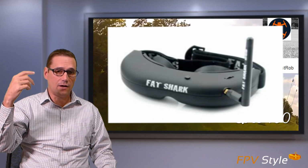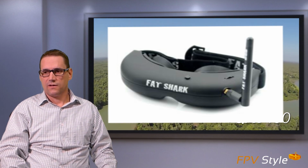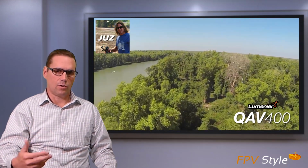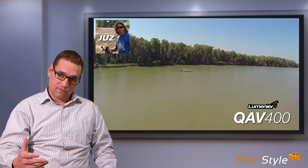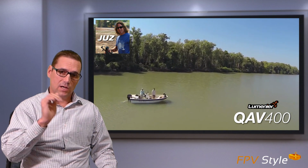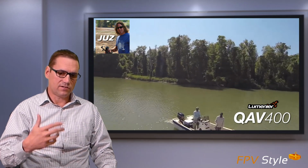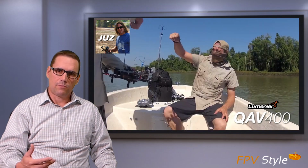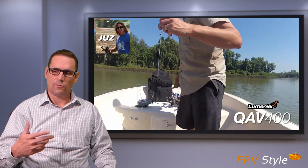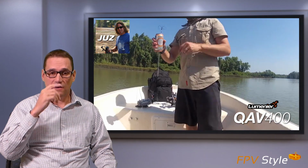But for the most part, what we like about 5.8 is it's easy and quick. Most of the time, you're going to buy FPV goggles, and you can buy FPV goggles with an embedded 5.8 gigahertz receiver, so it's a very simple, cost-effective, affordable, easy way to get into FPV. If I am going to do some flying where I know I'm going to be doing much longer ranges, I want to get behind obstacles, I want to do a little more freedom flying, then I'll bring the backpack, I'll rig my 1.2, 1.3 gigahertz transmitter up on my quad, and off and away I go.